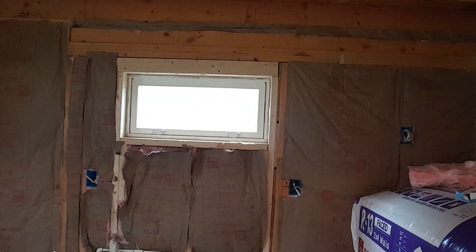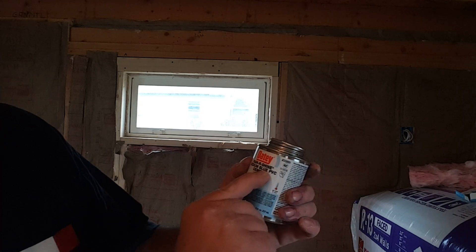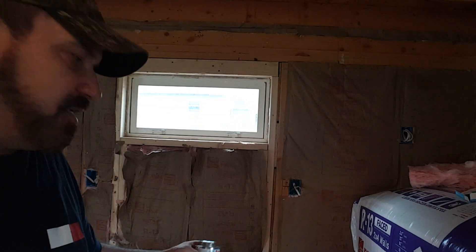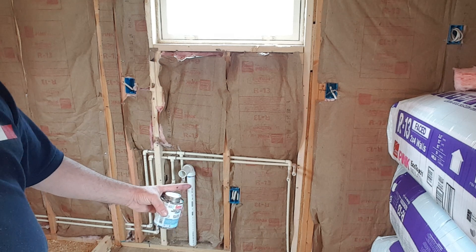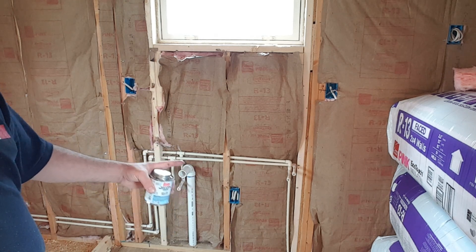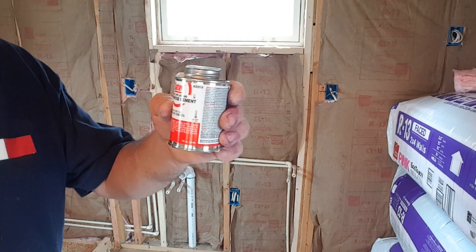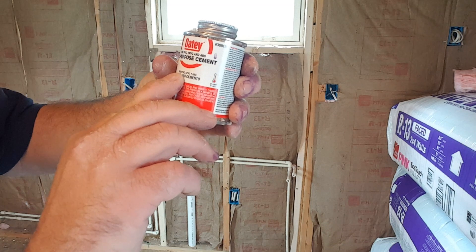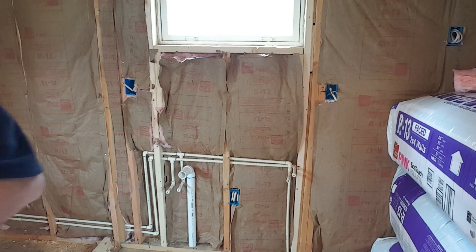The blue glue is good for my drain lines. My drain line is really, really white — that's PVC. The bone-colored water lines is CPVC. So we had to switch glues. This new glue does PVC, CPVC, and ABS. Some of you already know, some of you have very nicely asked me about it, and it brought it to my attention. Some of you have been kind of mean about it, which I don't know why you do that. So we used the purple primer cleaner.